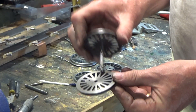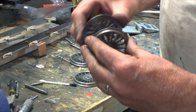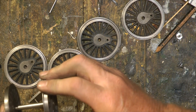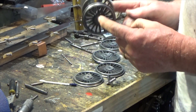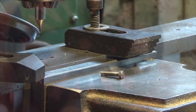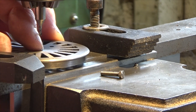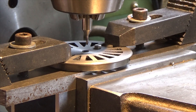What I'll be doing now is permanently fixing the wheels — locking them onto the axles so they don't work loose when the locomotive is running. For me the only reliable way to permanently do this is with a locking device and a screw. I'm going to machine a little slot in here and a little pin so the wheel locates on that. Now we're ready to mill the slots.